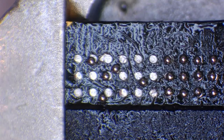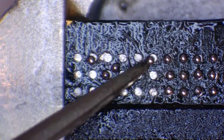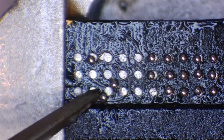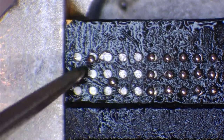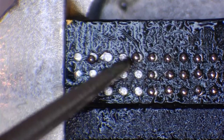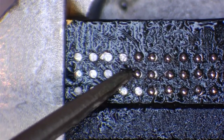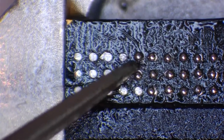And we're pretty much almost ready for stage two. Now, this is where it might get a little bit difficult, depending on how the grid is arranged. So if you have, for example, a PS4 Southbridge, or a PS4 APU, this is going to be very difficult. Now, what we're about to do: because we haven't got enough balls on the chip itself, we're actually going to need to add some to the chip.